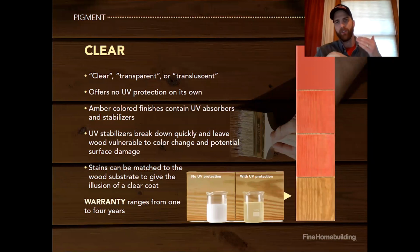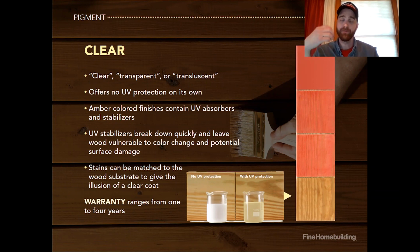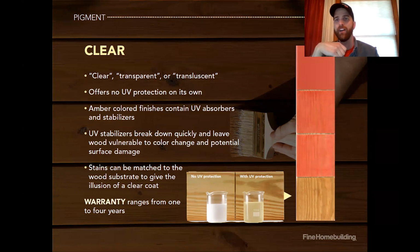If you flip that around and you have sand with gravel on top, it can't move from the sand into the gravel. So that's why you see people put down a layer of gravel as that last layer underneath the deck. It prevents water from wicking up any farther than ground level. So that's a great thing you can do if you're having trouble with your boards soaking up water from underneath: spread a layer of gravel under there, in addition to addressing all the drainage concerns.